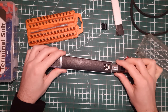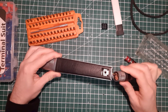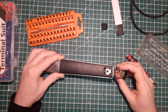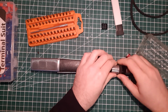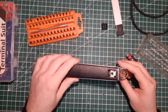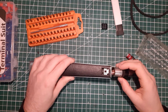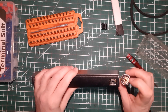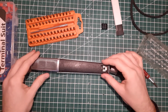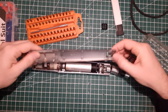Be really careful because the wires are tied from the switch to the XLR. It's not directly the XLR — you have a little rotating switch here, which probably has some circuitry like a resistor and a capacitor in series or parallel just to create the filter or the gain attenuation. And these soldering points are really fragile and important to maintain.